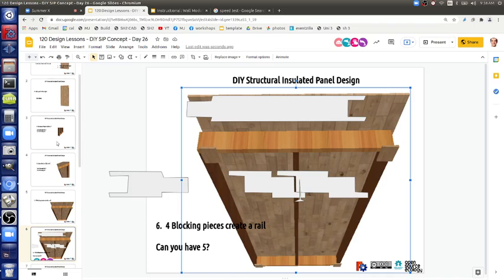Okay, so let's go back to the fifth block and why we started with four. If you have four, you know you have a defined sill plate. Yes, you can definitely get it on there. At the top, you know that you can go in or out to get them to go in perfectly. So say in the case of a badly warped panel, the middle is not going to go in if you had a tab there. So in a case like that, which is possible, we might say, okay, remove that fifth tab, and we're going to put a big block of 2x and suck it in. So that's what might happen.